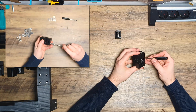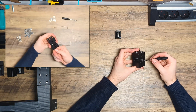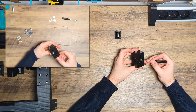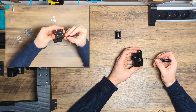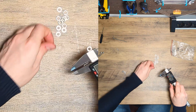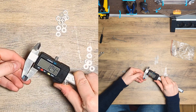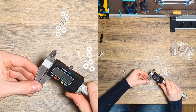Next, the bearing stacks for the gantry. Here we need one M5 30mm screw and one M5 40mm screw. Both stacks are similar: first an M5 washer, followed by two F695 bearings, covered by another M5 washer. It's important to handpick the best M5 washers for the bearing stacks — I bought a pack of 100 and noticed the tolerances are not always accurate and some were also bent.